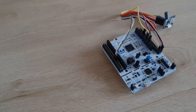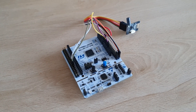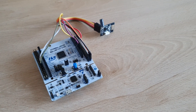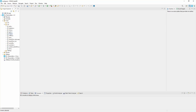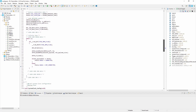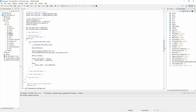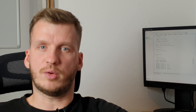To develop the radio communication I had to make a temporary receiver with another NRF module. Luckily I have a number of STM Nucleo evaluation boards in my drawers. The code itself is pretty simple — its function is to send the current positions of all analog and digital channels every 50 milliseconds. What useful things will be made of this information is up to the receiver. Currently the receiver just sends a confirmation that the data has arrived. I've described more detail about the code on my website, so I invite all the geeks out there.